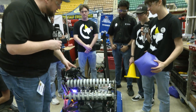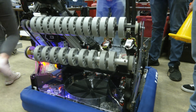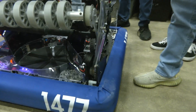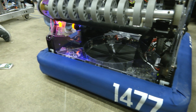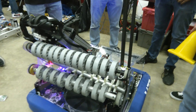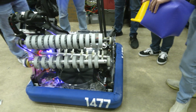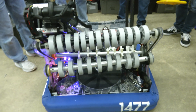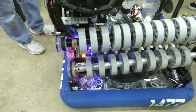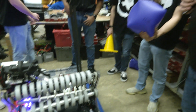Max, let's start talking about the ground intake. You guys have a super-wide intake with some huge wheels and custom work behind it. A big motivation for us this year was being able to intake pieces as well as possible, because we knew that was a really important element of the game. This intake allows us to pick up cones and cubes from any orientation. We used three sets of four-inch wheels — two on top and one Versa roller on the bottom — and the star wheels allow us to transfer a lot better into the Spindexer. It was a big challenge getting the packaging to fit inside such a tight space around the climb and the elevator. What allowed us to achieve that was a four-bar linkage on the top rollers connected to the bottom rollers through another linkage, so that complicated mechanism pulls the intake up inside the bot and deploys it to the perfect position.